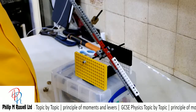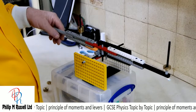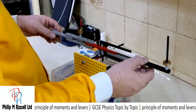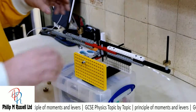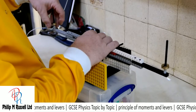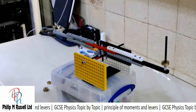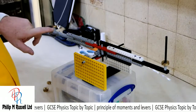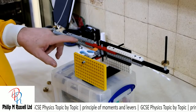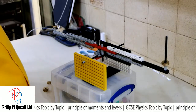Imagine a little kid on one side and a bigger kid on the other — if I move one mass much nearer the fulcrum, I now need about three masses on the near side to balance one mass on the far side. If we decrease the distance, we need to increase the force to match.